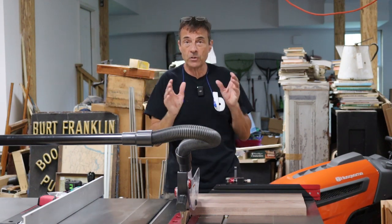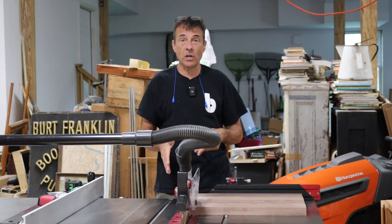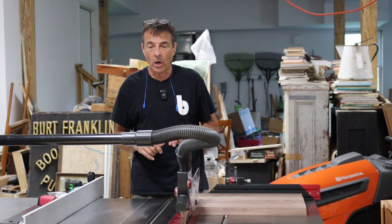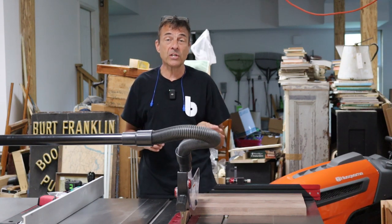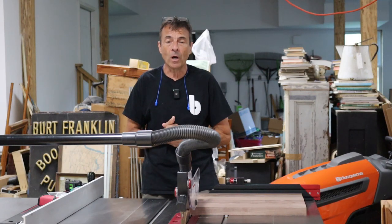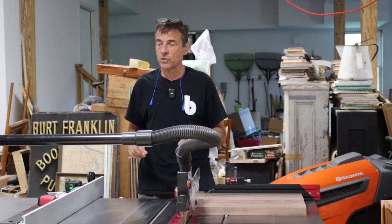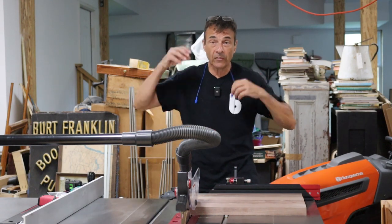So right now I need to square the ends on this and get two 8-inch crosscuts off of this piece. I've changed out our blade. We had a premium rip blade in there, 36 tooth. Now we have a premium crosscut blade, 72 tooth. Both the blades are made by Leitz in Germany, made for and resold by Harvey Woodworking Machines. So let's get these cuts done.